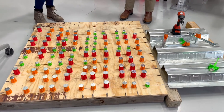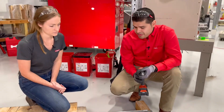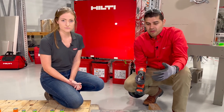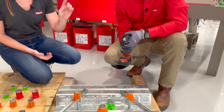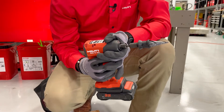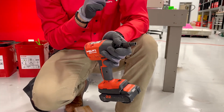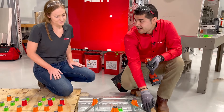We have our wood deck done — what about metal? Our metal deck cast-in-place anchoring solutions are demonstrated next. There's an accessory needed: an impact or drill. The process is the same as the wood form application — locate your color-designated anchor points, drill the hole, and begin. This is an innovative stepper bit, similar to the auto setting tool for flush anchors. It's a two-in-one system: a stepper bit to drill the hole, and when you remove that piece, it's also a nut setter. It allows us to set the screws that come pre-assembled on the anchors themselves.